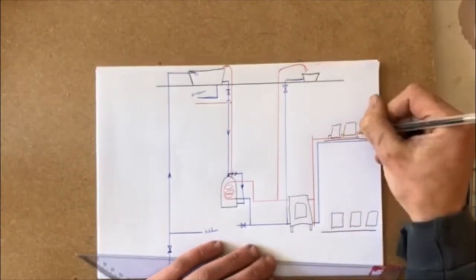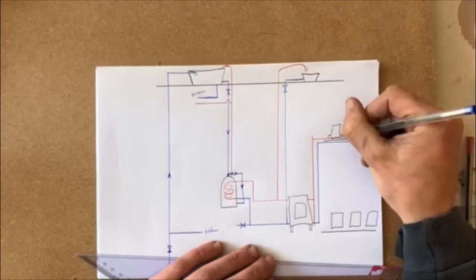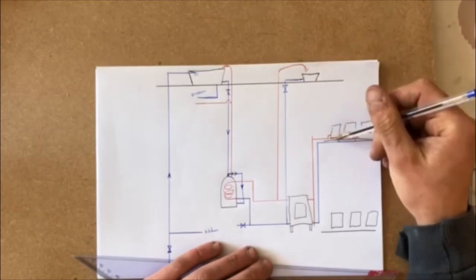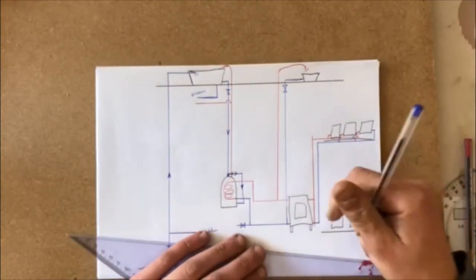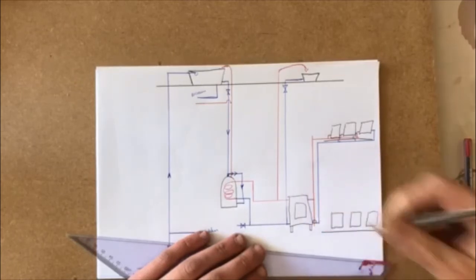Okay, now obviously if it's coming out of here, then it's going to come out of this one, overlap the hot water, and same here, down, overlap the hot water and into the cold. So I could turn off this radiator here, hot water still flow to this one, and it's still all be able to return down through here. Oh, I know why I brought that line down there then, sorry. That should loop over there.